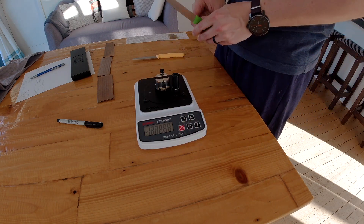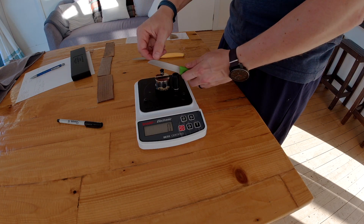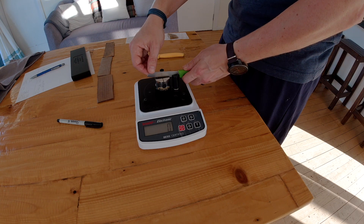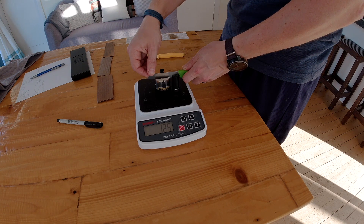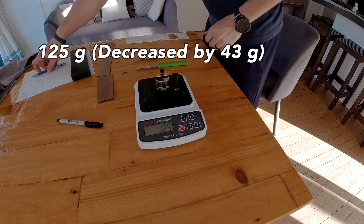Now let's see how the other one did — it was all the way up at 168. What did the kangaroo do here? I should mention I was going to add chromium oxide to this video — I just mixed up some pure chromium oxide paste — but I didn't realize that chromium oxide paste actually has to dry for a full day before it's ready to go. Anyway, the result is 125. Not bad, kangaroo! That's recommended by Vadim Krychuk of Knife Grinders.